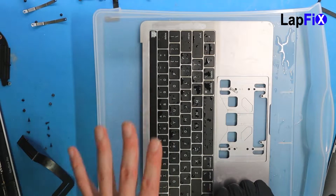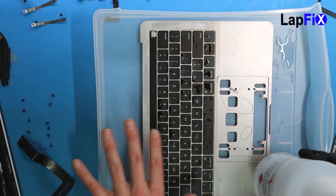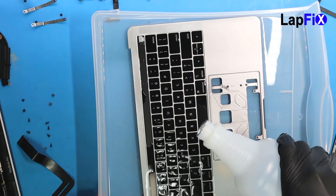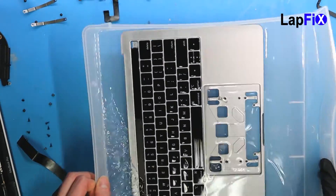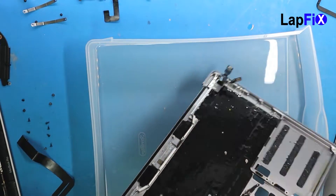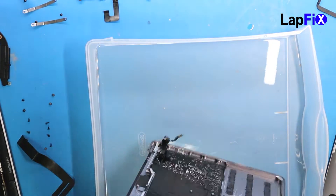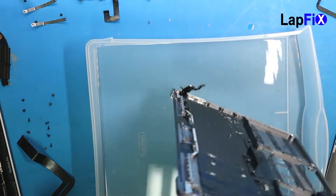Now, because this is water mixed with a solution, we definitely want to make sure you get 99% or 100% alcohol. What the alcohol is going to do is push out all the water that's in contact with it. Now that we've pretty much soaked the whole thing in alcohol, all the water should be pushing out. Before you totally finish up, you don't want to put it back like this — you want to make sure it's completely dry. Definitely leave it with a fan on it for a very long time, making sure everything is completely dried up with no wetness, residue, water, or alcohol left.